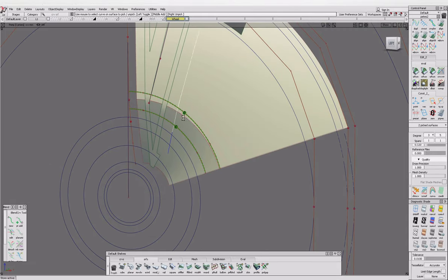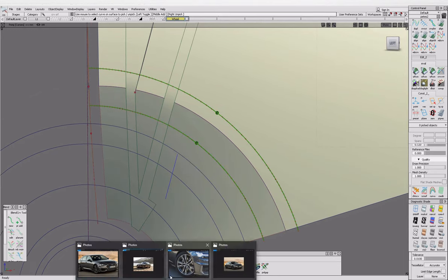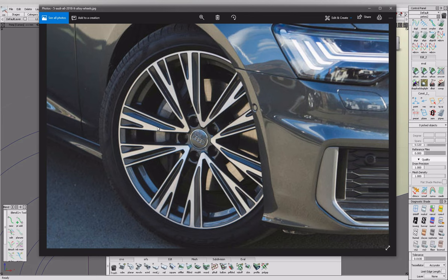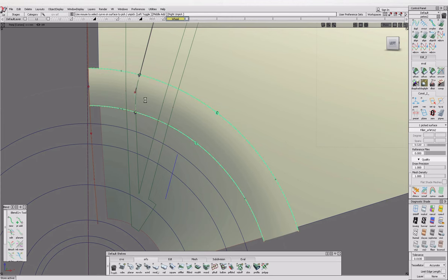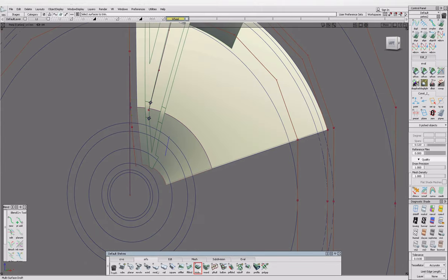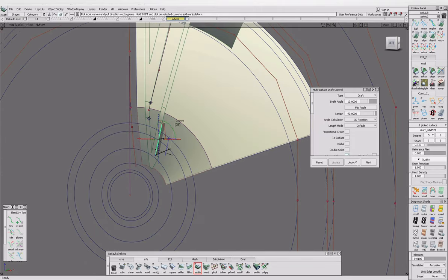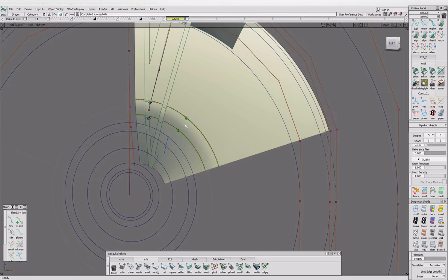Right, and do that draft technique again, but this time it'll run around that fillet. This one actually will need a blend curve there, I think, won't it? Yeah. Let's give it a blend curve. One, two. Just untrim that. So get rid of those. Project that on. Trim. Okay, yeah, do that draft technique again. 15 degrees. Oh, actually, let's give this inner one the same radius. Sorry. I'm going to delete history, and I'll do the drafts.